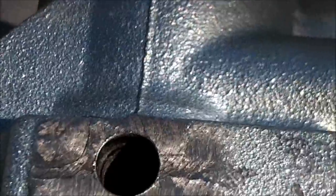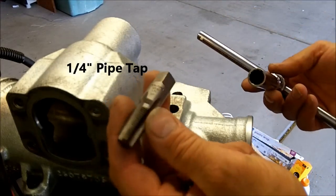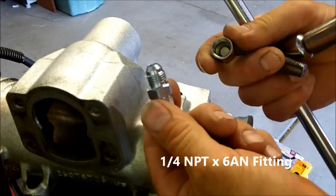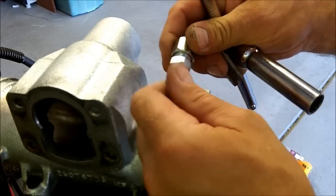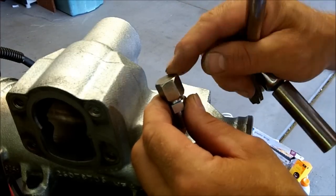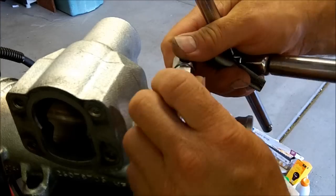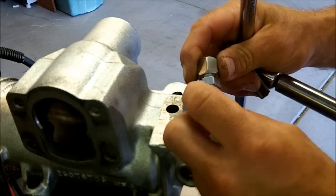Now we're going to cut our threads. What I've got set up here is a quarter-pipe thread tap, and we also have the quarter-inch pipe thread fitting to a 6AN. These are both steel fittings — I got them from Redneck Ram, best price I could find. Even though you may be hooking this straight up to hydro assist, always get the steel caps. What if you're out in the field and one of your lines fails, or the cylinder fails? At least you can grab your caps, cap this off, and keep going. These will stand 3500 PSI, where the aluminum fittings will only go 2500.